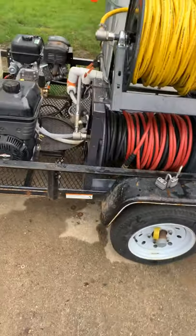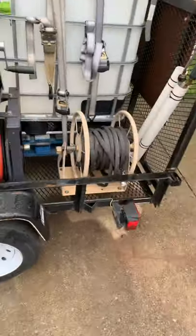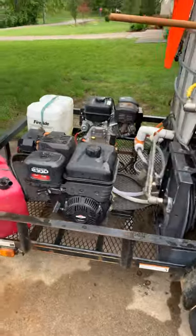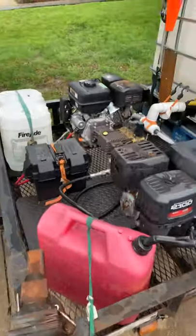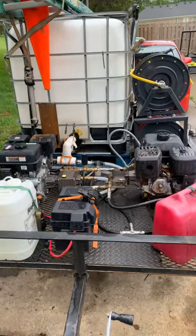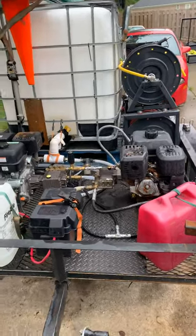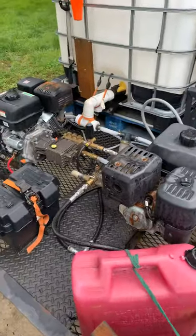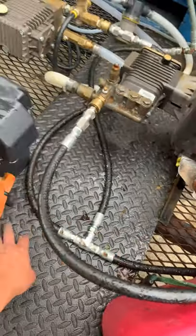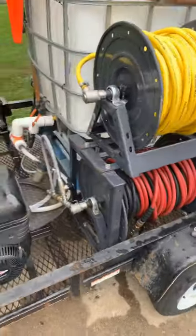Is there a more efficient way? Probably. But from what I've learned, researched, and done out in the field, it works great for me. If you had any ideas or were wondering what you could do for your setup, I hope this helps. It's probably not the best setup, but it works for me — it's clean in the sense that everything's got a good place and it functions well. You probably noticed this mat here — I put it so the hoses aren't laying on the metal grate, because the vibration will rub against it and rupture a line.